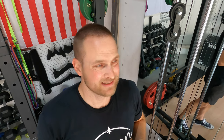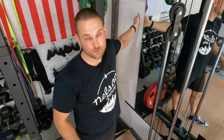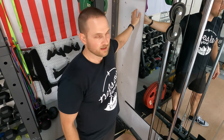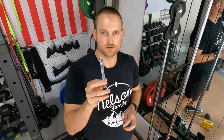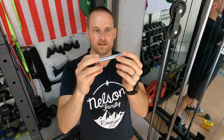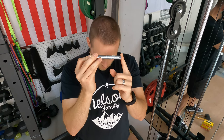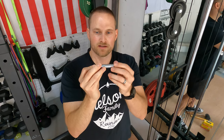As sort of expected, drilling into the concrete wall is proving to be a challenge — that's sort of why I avoided projects like this in the past. It took quite a while to drill in. Following the directions for these cement anchors, I pre-drilled the holes and then I'm going to use a hammer to hammer them in. The way this works is you tighten one end once it's all the way in, and that makes the other end flare out, which is what keeps it secure in the wall.